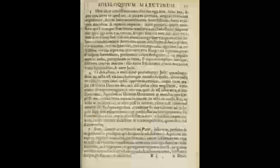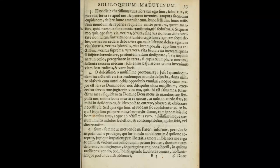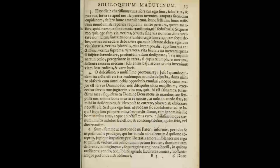4. Assuming a cubical ingot, 300 g of copper would have a volume of about 33.6 cubic centimeters. The density of copper is almost equal to 8.96 g/cm³. This gives us an edge length of about 3.23 centimeters. 5. The surface area of this cube would be about 62.5 square centimeters. Calculation: volume of copper, 33.6 cubic centimeters; corrosion rate, 0.013 millimeters per year, equals 0.0013 centimeters per year.